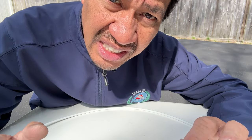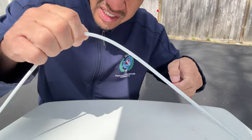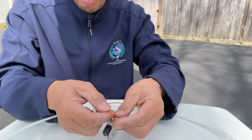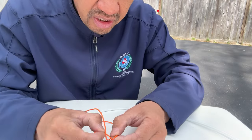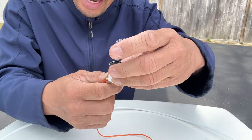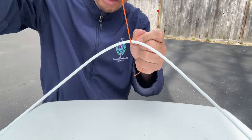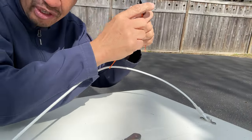You could use other blocks if you don't care about being class legal — you could use a Harken or a Ronstan. But if you're going into a class legal event like a Regional, North Americans, or higher, you have to have class legal equipment. I also have this non-stretch line — I don't know exactly how long I need, so this is about a 20-inch line. We're going to latch this right onto here and tie a bowline. You don't want the boom block way up high because when you trim your sail you can't trim it all the way in — the mainsheet will hit the block.